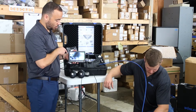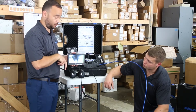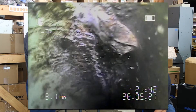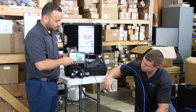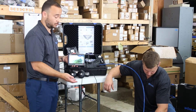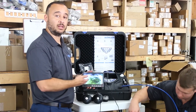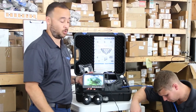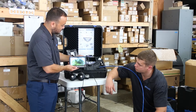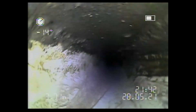What we're going to do now is go down into the drain itself and approach the T area where the pipe splits. We've reached the basin right there — you can see a still shot of a little water down there. This is essentially a pipe that doesn't get used very much, but there still is some traveling water. In these instances it gives you a good understanding as to whether there's a leak from somewhere else traversing into what should be a dry pipe. From this angle we'd like to use the pan and tilt feature to see if there is an entry or exit point on this particular pipe assembly.